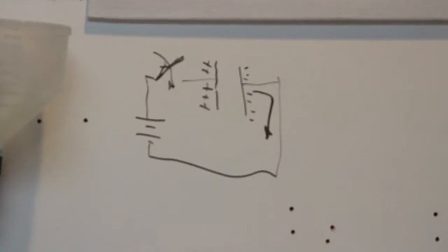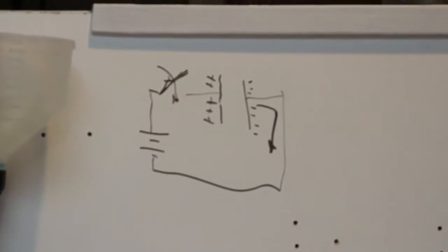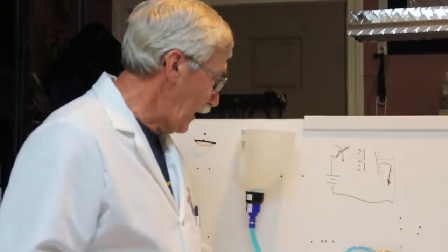What is the dielectric usually made from? The dielectrics are made of many different types of materials. There are ceramic dielectrics, there are tantalum dielectrics, there's polypropylene dielectrics, all kinds of plastics are used. Just about any kind of an insulator you can think of has been used in capacitors, some more successfully than others. But think of it as just a simple, very thin insulating material.